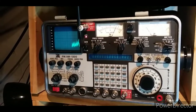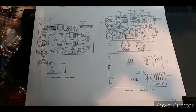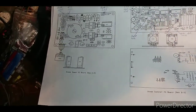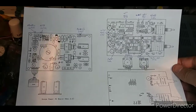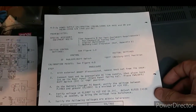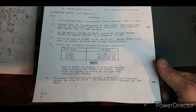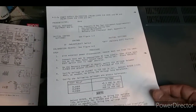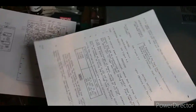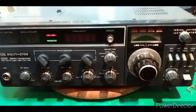Just for reference, I did do an alignment on the power supply, and there was this drawing here for the scope control board — that was all aligned and calibrated. I also adjusted the power supply to make sure the proper voltages were correct. This came right out of the service manual I found online. Not sure if I found the one for the 1200 — this might have come out of the 1200S book — but I don't remember.